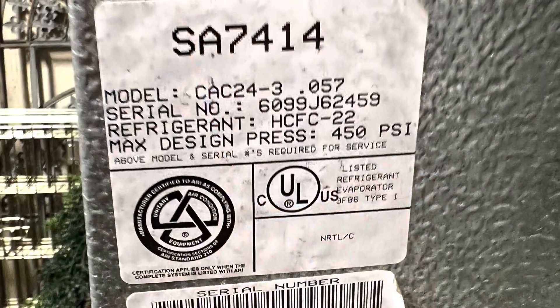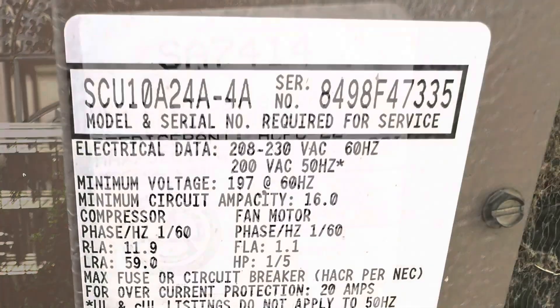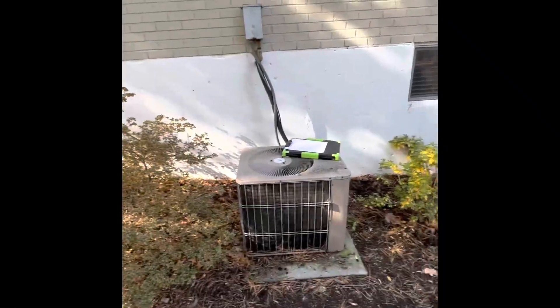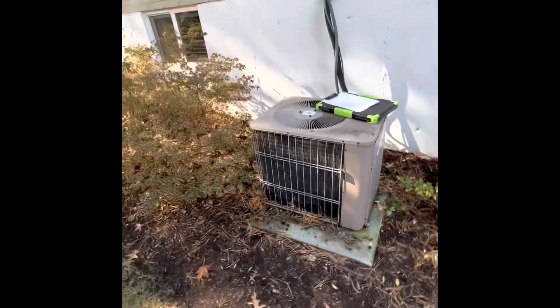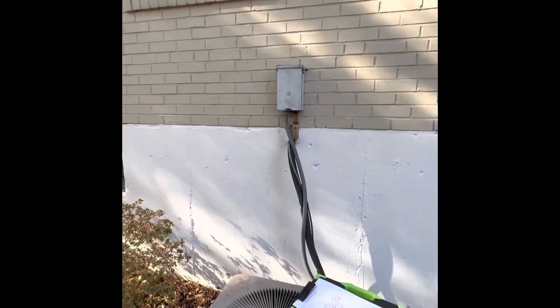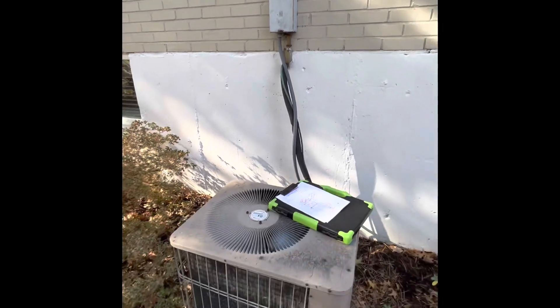We're at the outside of the Magra Residence looking at the AC unit. We'll rip up the pad, put a new poly pad down, and level it up — it's got a little bit of a lean to the right. New electrical disconnect and whip coming back to the unit, and then we'll flush and pressure test our line set. It's three-quarters, so we're sized accordingly.